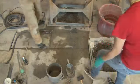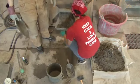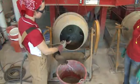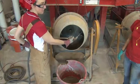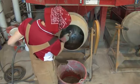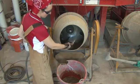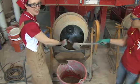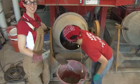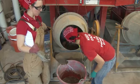When you think most of the concrete chunks are out, you can hose it down. Make sure you spray down the drum after you get all the chunks out. You should be able to see the shiny silver inside. You'll know you're done when you can do what I call the white glove test — put your hand in there, and if any cement comes out, you know it's not clean yet.